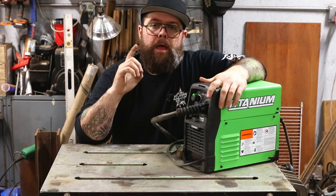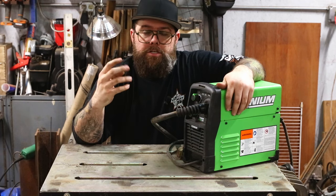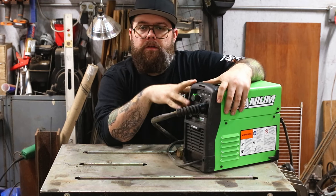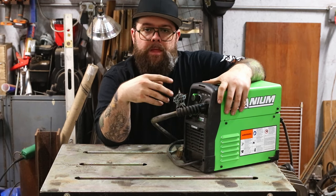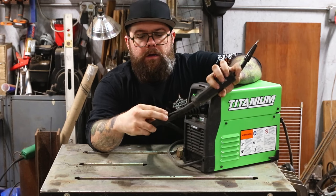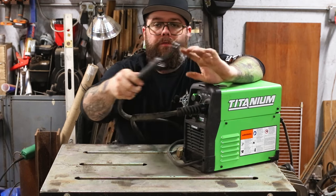Actually, I take that back. I had one problem with this machine, and it's actually the only machine I've had a problem with. So everyone knocks import machines for being cheap and low quality, but yet the Harbor Freight machine is the one I had a problem with. The relay in here got stuck for the wire feed, so it would continuously just feed wire without pulling the trigger on the torch. A quick tap with a screwdriver on that relay freed it up and it's worked fine ever since — though I'd already cut into the covering on the lead trying to see what was going on.